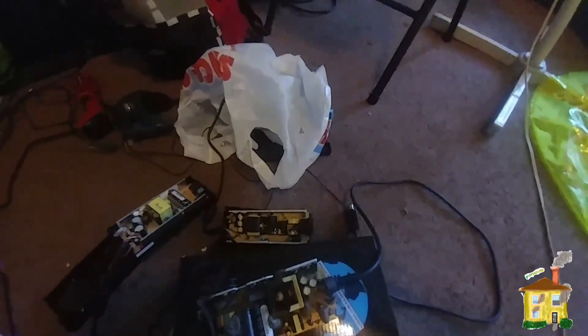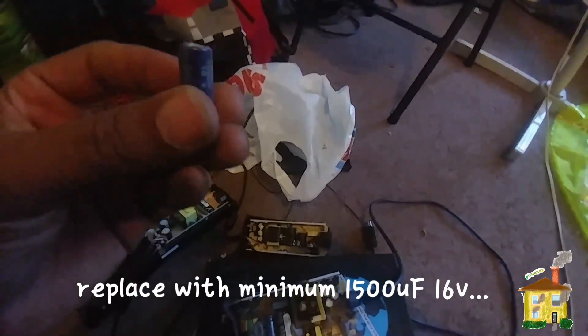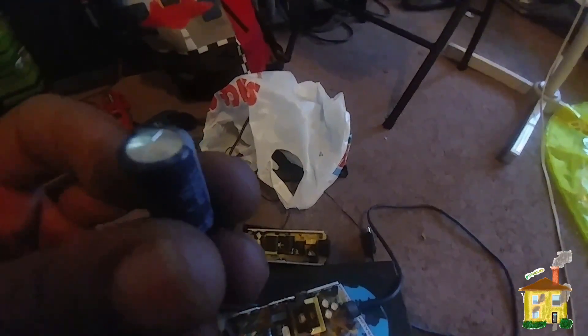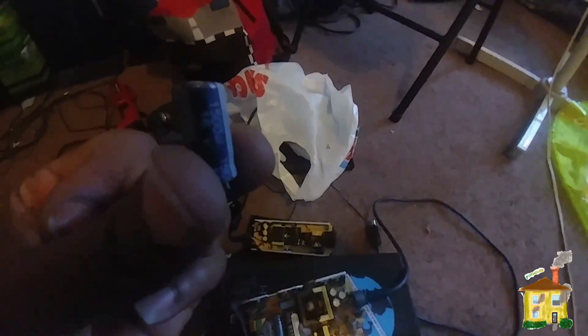This thing isn't working and I can't play the video game — I'm angry. So this right here, let me turn this around — this capacitor right here, this one exploded. You can see how it's bulging at the top. Let me get you a better shot. Basically this capacitor is bulging, and that means it's a bad capacitor. That's your bad, blown capacitor right there.